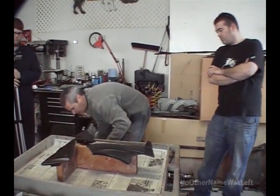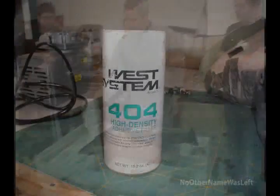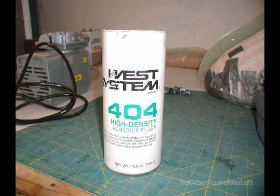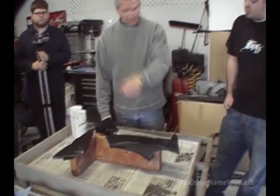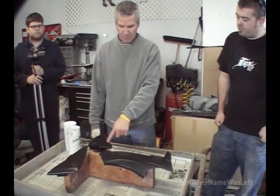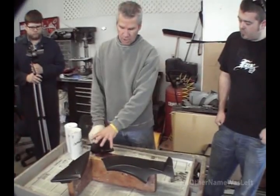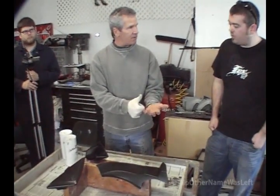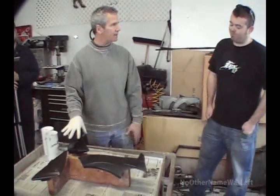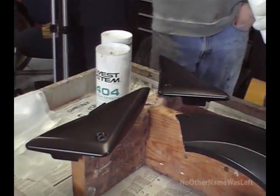What we're going to do is make it simpler on ourselves. We're going to use filler mixed into the epoxy to make a paste, and we're going to fill all these tricky spots and just eliminate them off of the surface. That area will be filled with filler, then fiberglass will go over the rest of it, and once it's all cured and you pull it off, your mold will have a positive of that. Your part will look exactly like this when you're done — you want it to completely conform to that shape.